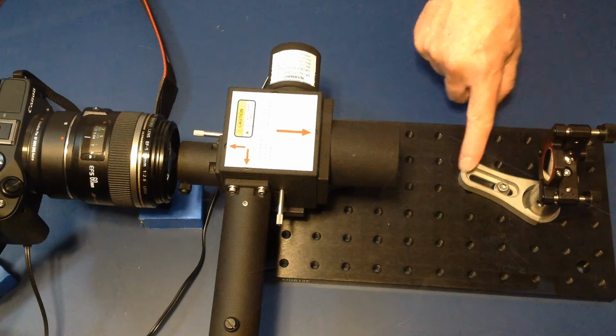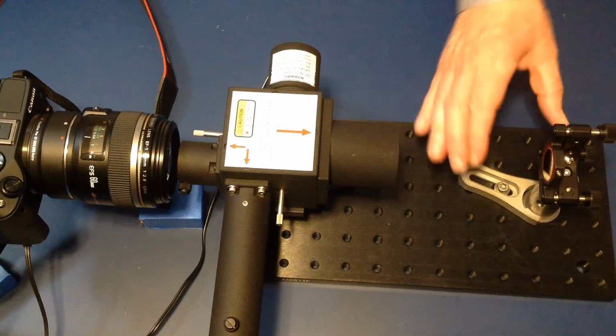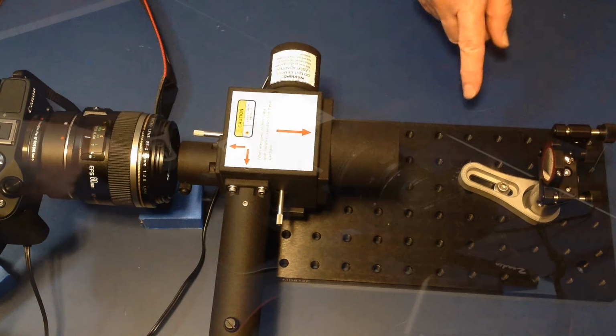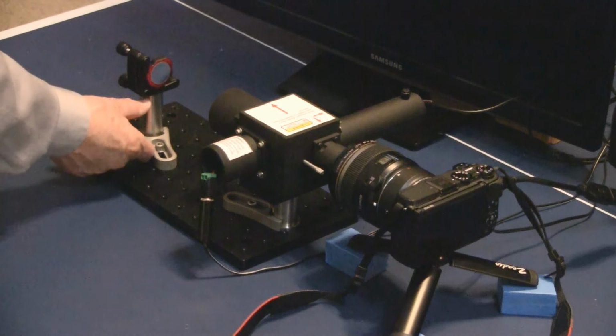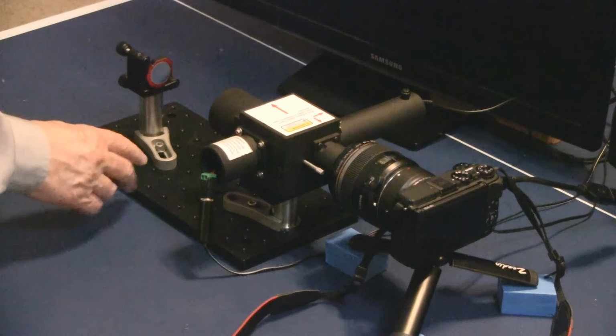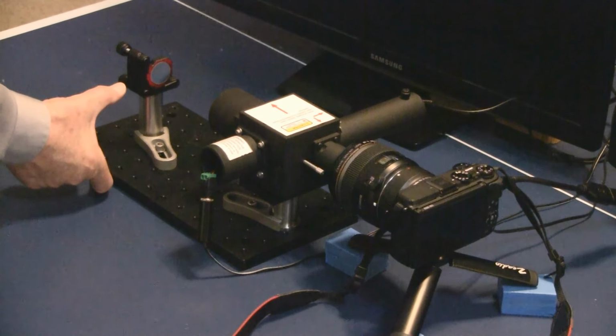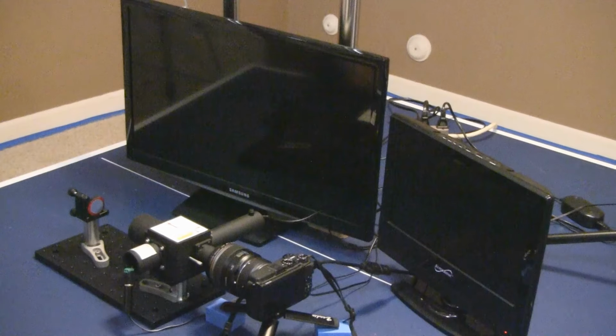Use of these clamps allows for a quick and easy adjustment of the position and orientation of the SPPDI and test mirror on the base plate. The lengths of the 1-inch diameter mounting posts were chosen to provide for a 3.5-inch height of the SPPDI and test object above the base plate, or for a height of 4 inches above the surrounding desktop.